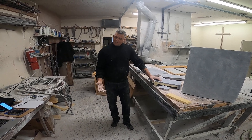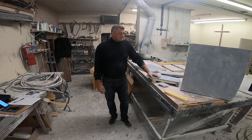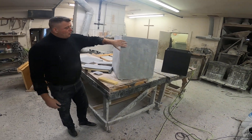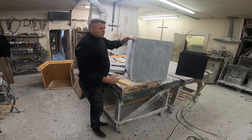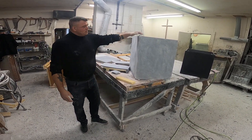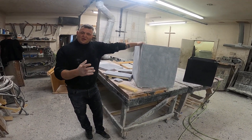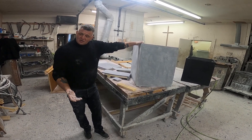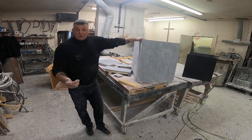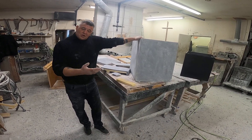We do any size, and that's not easy. The thing with fiberglass is to keep it straight — to keep the walls straight, to give it that very chic, straight look is very difficult. The fiberglass wants to move with any little thing that will allow it to move, such as drying time. You dry it too fast, it'll warp. You wait too long, it'll warp. You turn around and don't structurally support it correctly, it'll warp.